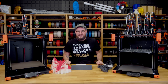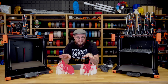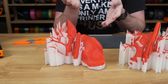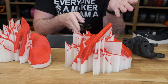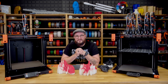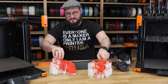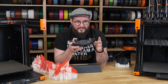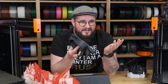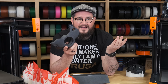Let's talk about the tool changer now — I have some models over here. We expect one of the popular combinations will be PLA with water-soluble supports from BVOH or PVA, and the XL can handle these with ease. There is no cross-contamination in the nozzle which would compromise the integrity of the PLA model, and there is no need to wipe excessive amounts of filament to clean the nozzle — just a small priming tower so the start is sharp on the model. You also don't always have to use expensive BVOH for water-soluble supports; you can combine PLA and PETG instead, because you don't have to dry it out — it's cheap and everyone has it at home.